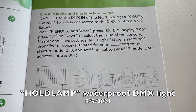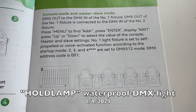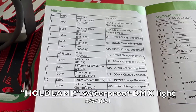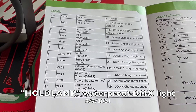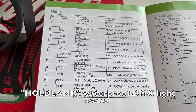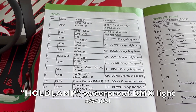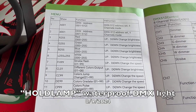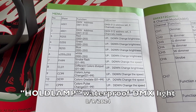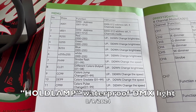The manual shows how you would daisy-chain the lights together by running the output of the power and the DMX into the inputs of the next lights. It has your standard automatic modes, like choosing a preset color or mixing your own specific color using red, green, blue, and white. You can also put it in modes where it will strobe, flash, fade from colors, jump from colors, pulse, or be sound activated — and that's what it can do without any type of DMX computer driving it.